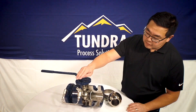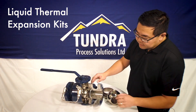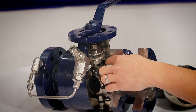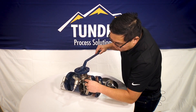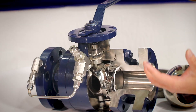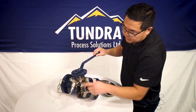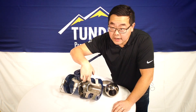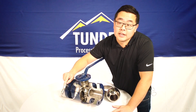One of the ways we protect against that is liquid thermal expansion kits, also called liquid relief kits or LRKs for short. In the closed position, you have your center cavity between the upstream and downstream seat carriers. When double piston effect seats are isolating the center cavity from your process fluid, pressure can build up from liquid thermal expansion trapped within the ball as you stroke it. The LRK is a small pressure relief valve that will relieve your internal center cavity pressure to the safe side of your valve — either the upstream or downstream side, depending on what you're trying to isolate.